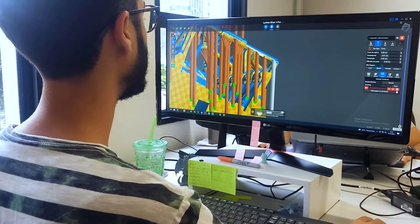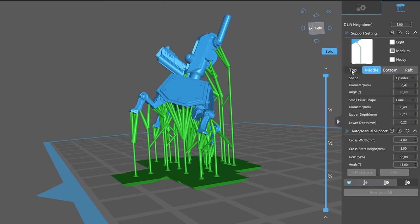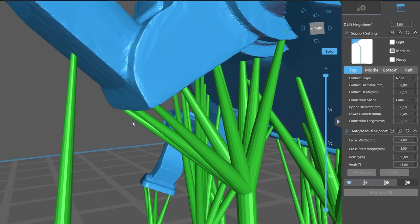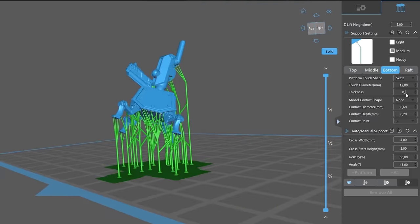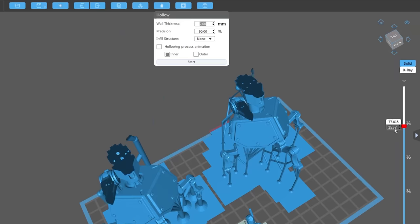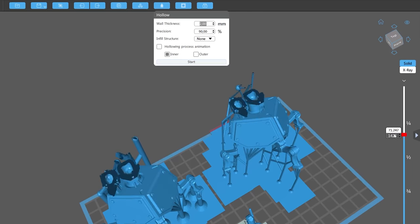The third option is more complex and it's not an exact science. Errors can occur because a change would be made to the original project made by our team at LUT, where we test until we have the guarantee of a flawless print. The idea here is to modify the supports created initially to make them thinner, so when the scale is applied to the solid model, it would be possible to have a large part with thinner supports. After increasing the scale, we can make the part hollow, reducing material consumption.